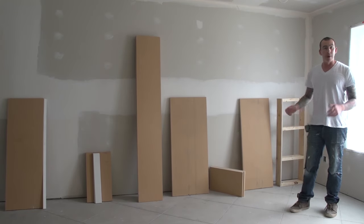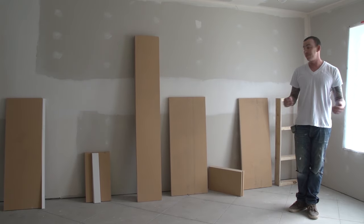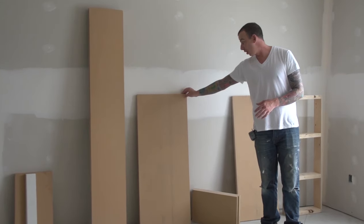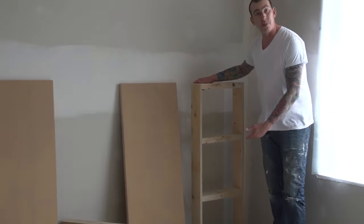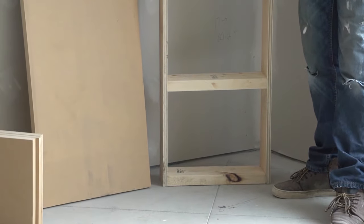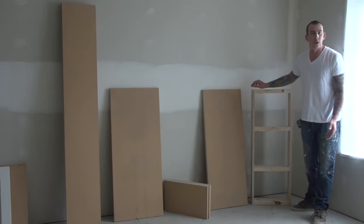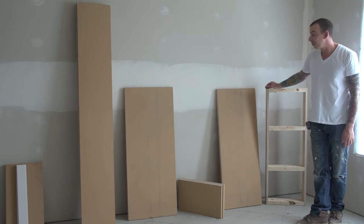Okay, so I'm back from the garage. I've got all my cutting list cut. For this project, I'm using 1-inch thick board, using some standard trim pieces just to dress up the wood a little bit. And I've built just a base like I did in my bathroom cabinet, except I used 2x6 cut down to size as the studding here. I just ran out of 3/4. It truly doesn't matter what type of wood you use for the studding there.